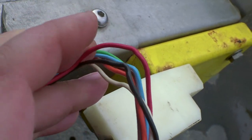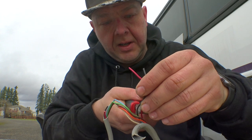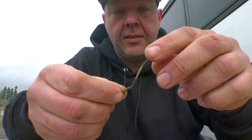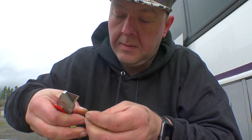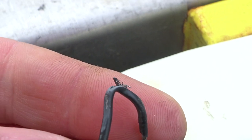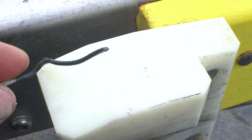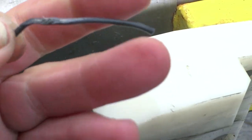I'm going to dissect the sheathing on there — I'm curious to see how broken it actually is. I'm going to cut these sections out real quick. These other wires have a little bit of a bulge, but they don't flex over — they still have some structure left. Oh, and it's aluminum wire too. If you look right here, you can see those strands of wire poking out, and down inside there, there's no strands left — there's one little strand right down there. So as this flexes, it'll connect, but when it bends up, we're going to have a break.